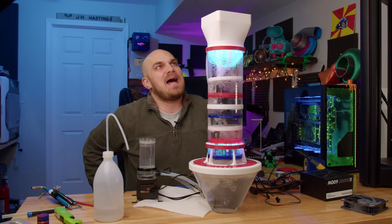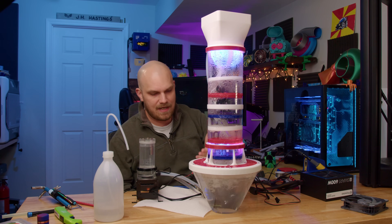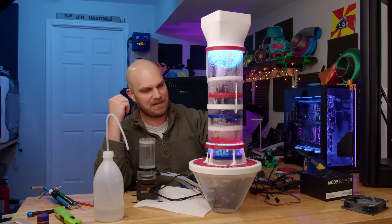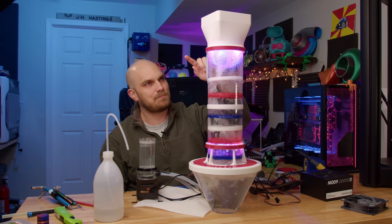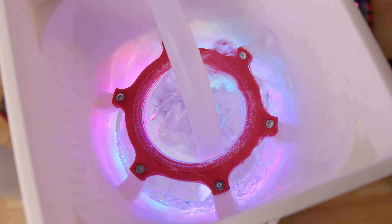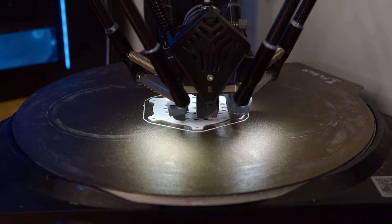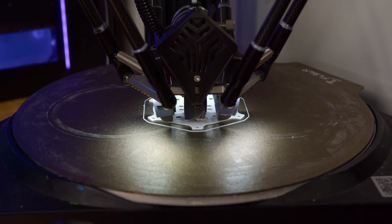Good news and bad news. The good news is after about five hours, there's no water anywhere — the bulkhead is holding, nothing is leaking. The LED around the fishbowl looks great. The problem is the gap between the fishbowl and the fan shroud is so tight that when the water is running full speed, it basically seals it off. With the fan up there, it's pulling very little air through the tower. Without airflow, this simply won't work. So I'm going to have to replace the fishbowl with a nozzle or showerhead-type thing, which is printing now.